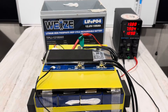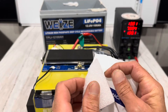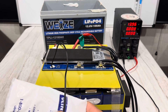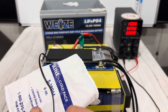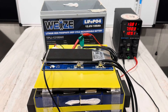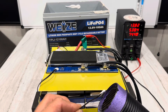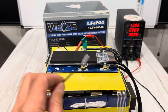Let's check the low-temp cutoff on this temperature sensor. I'm applying my colder-than-ice ice pack — watch the charger over there. If it works, the charger will drop out. There it went — took exactly one minute. So there's a one-minute delay in the BMS before it shuts off charging. Now warm it back up and it should go back to charging. There it goes — nice. Now let's check the high-temperature cell cutoff. I'll heat it up and it should drop out. It dropped out in 20 seconds. Cool it off — there it goes back on.